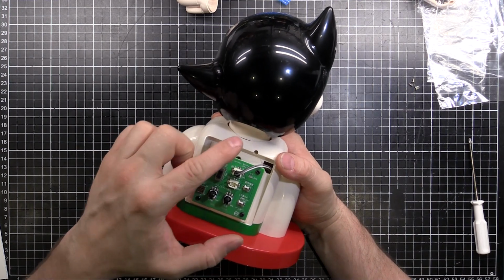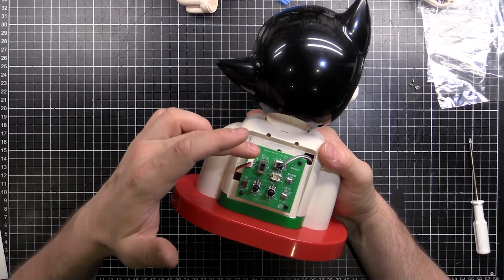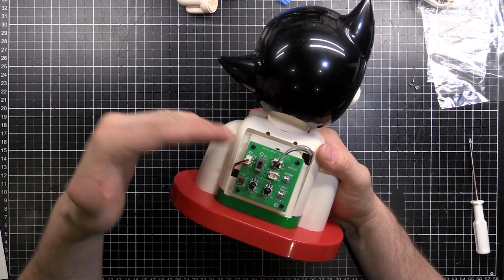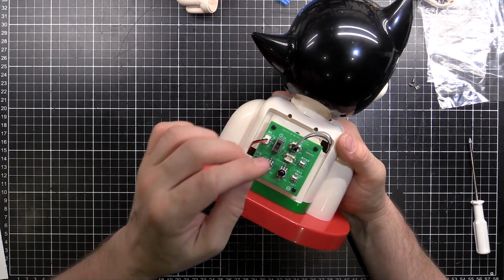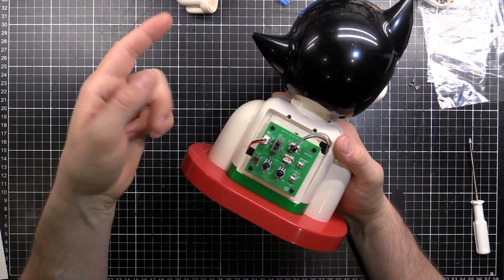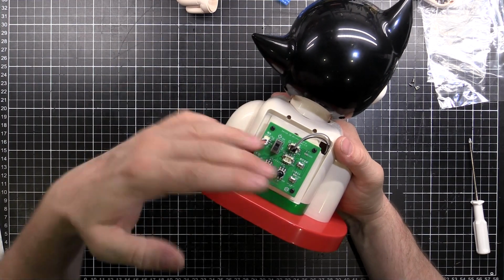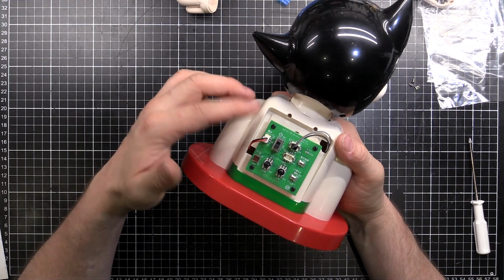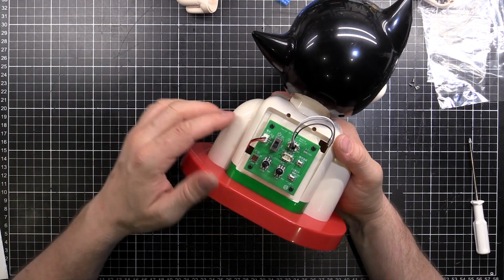The servos seem like they're daisy chained, they run in serial. So you only have to run one set of wires down the chain and then you address each servo differently. 1, 2, 3, 4, 5 sort of thing. And then when the microcontroller sends a signal, it says this is for servo 4, turn this much this way. And this is for servo 3, turn this much this way. That way you don't have to have individual wires coming back for each servo, it's just one little loom and it just daisy chains all the way along.